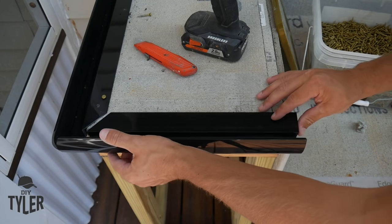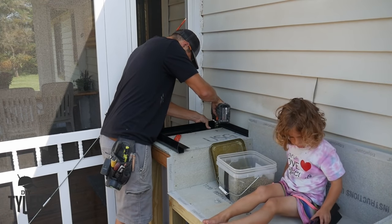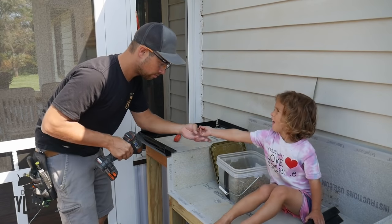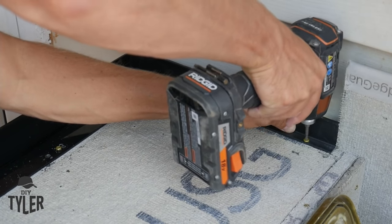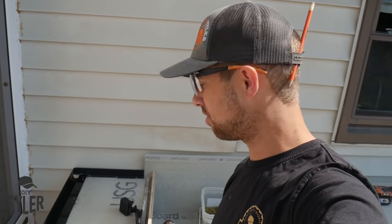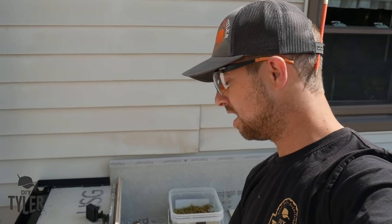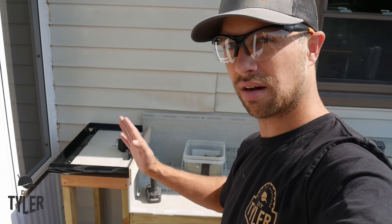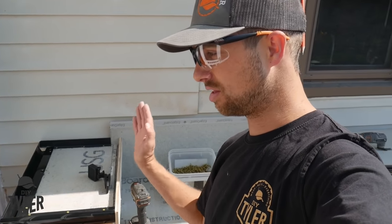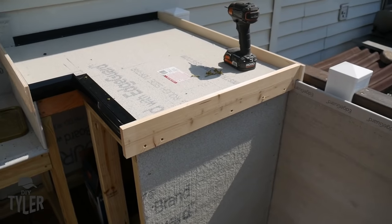Here you can see the portion that's going to be screwed down into place. You seal the seam to make sure concrete doesn't seep out, pour the concrete in place, and then you actually snap the bull-nose portion off. There are several different designs, and you are ready to go — it's pretty cool. I got the first Z Countertop section done right here. This uses their stay-in-place back form. I need to get some tape in the corner, and then this board will get removed where the griddle goes, because I don't want to see the black Z Countertop form edge — that'll just be the concrete edge.